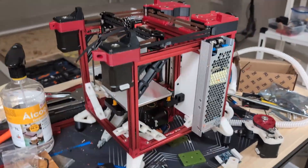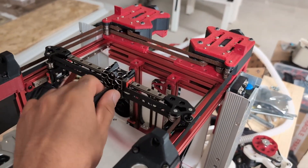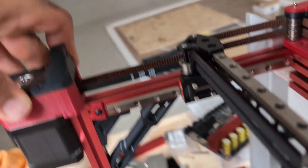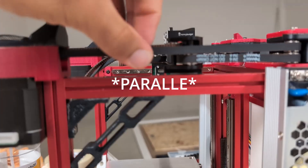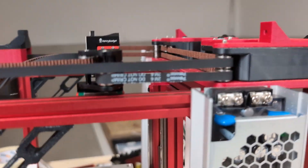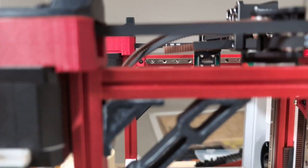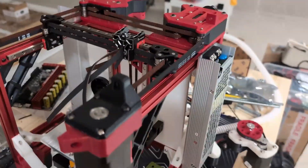I've done an absolutely horrible job of filming for this printer, but it is coming along really well. I think this is the first update with the belt attached, and I'm very happy with the results so far. I was just checking the belt alignment — all these belts need to be as perpendicular as possible. I'm realizing my gantry sits higher than I expected, so realistically everything should have been positioned higher so the belts wouldn't have any angle. Not much I can do about that right now unless I remove the pulley and move it up slightly — I'll add that to the next revision.